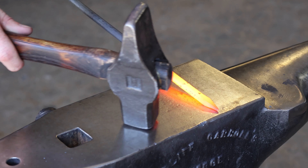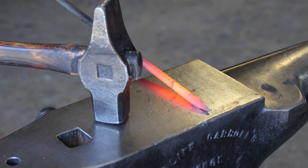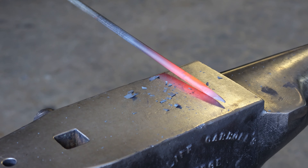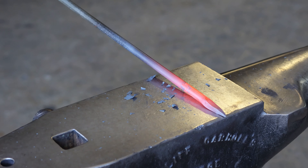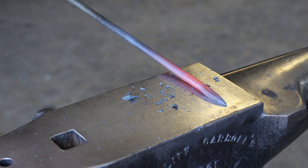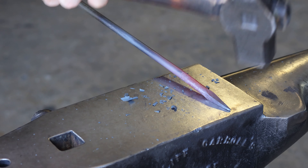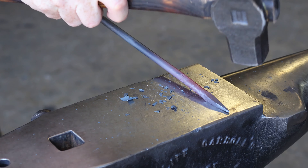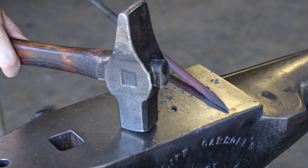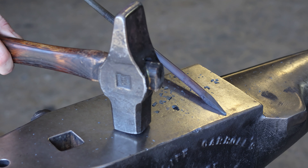I look back at the drawing — healthy reminder, this tip is not meant to be perfectly sharp. It's going to be a 1/16th of an inch, which is about where I've got it. So I'm going to extend this taper to 1-3/4 inch long. The reason I've decided to go with this part first is because the tapers are simple. It'll build my confidence for the remaining parts to come and it gives me a nice warm-up.